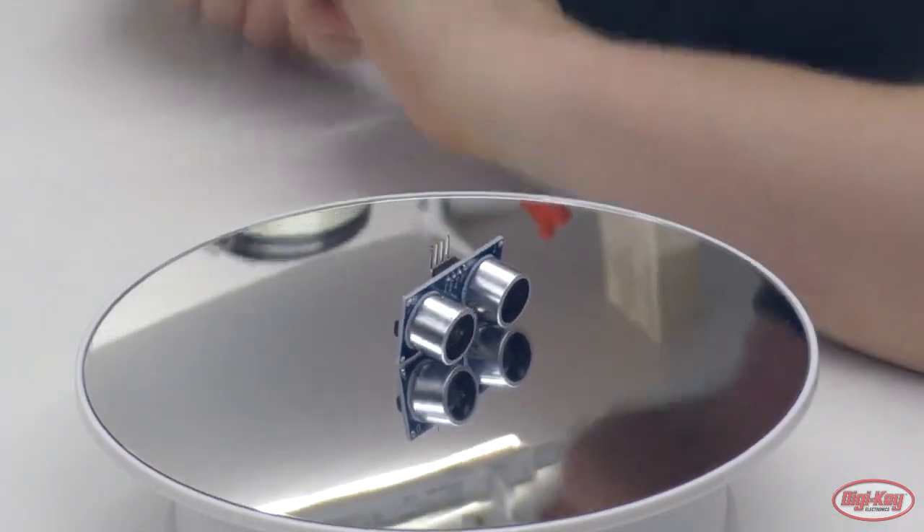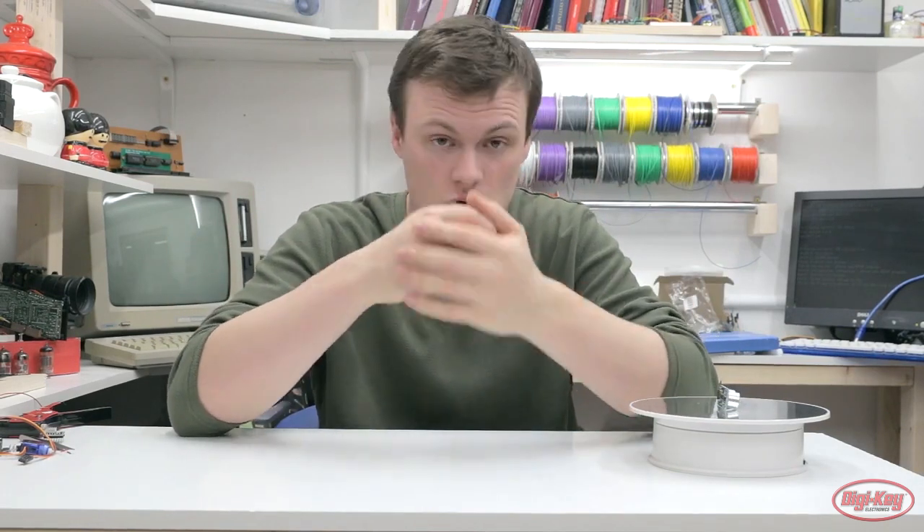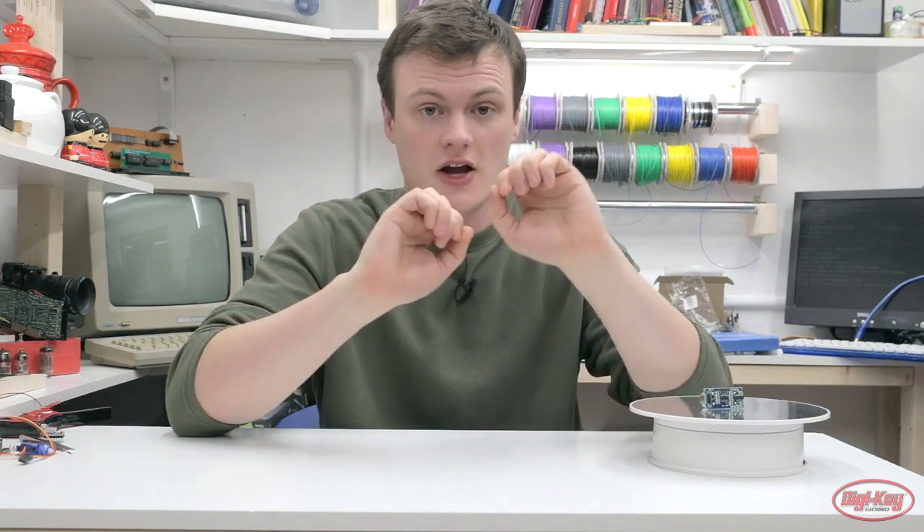There are different ways you can mount these sensors. You could have multiple fixed sensors on the robot looking around it, or you could be more clever and use a servo — having the sensor sit on a turntable as shown here, rotating and making pulses to produce a map. The rotating approach takes longer because you have to move to a position, take a reading, return, adjust, and take another reading. Fixed sensors do limit your field of vision, and if you have multiple sensors it's a good idea to shield them from each other so reflections from one can't interfere with another.